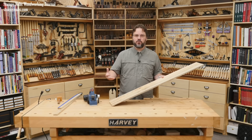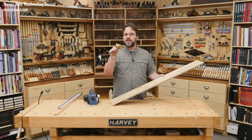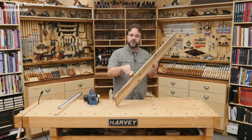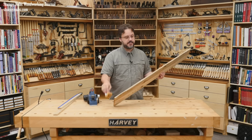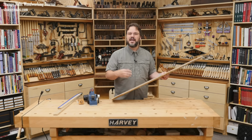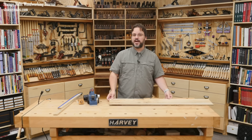I mean, in the old days before power tools, it was done manually with hand planes. What they would do is set a marking gauge to whatever thickness that they wanted. Of course, it would have to be less than the thinnest part of their rough board. Then, with the fence along the good face, they would scratch a line along all the edges and ends, all the way around the board. Finally, they would plane down their rough surface to that line. I think that's more difficult to do with a power planer than with a traditional hand plane, but technically it could be done with practice.